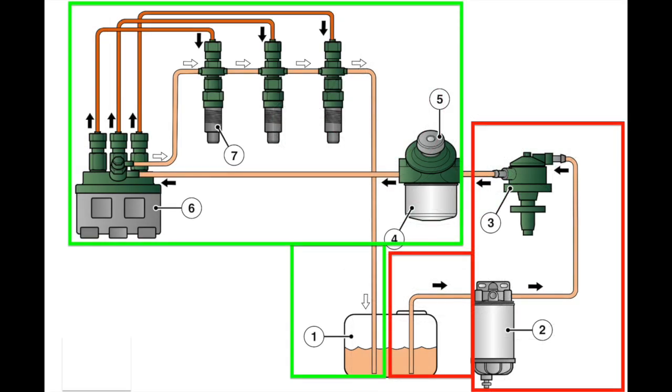The fuel reaches the injector pump, which is timed to deliver diesel to the injectors at very high pressure. Some of the fuel delivered to the injectors is routed through a return pipe back to the tank — this allows the injectors to be lubricated using the diesel. A byproduct of this process is that your fuel is polished as it goes around the system, and that's basically how the system works.